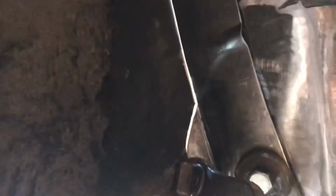At least get some of the tacks on, and then I can pull the fender out again, and I can tack this all out from the inside, or outside rather. This piece. But I want to get a couple tacks up there. Anyways, I am going to go under the hood. I don't know if you can see a gap. Just a very nice, fairly consistent gap all the way up. About a MIG wire, 023 wire gap.